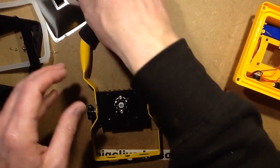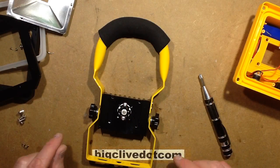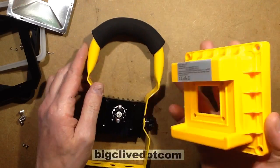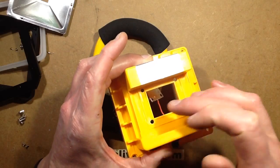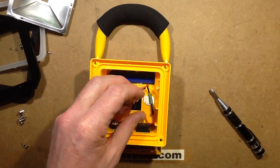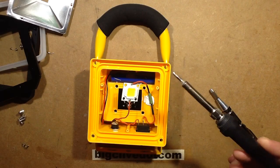I'm wondering now if the LED is going to stick up too proud, and whether those screws are going to stop the reflector going in. I guess there's only one way to find out — I can always change them for the original shorter ones. Now is also the point where I could have put some silicone sealant around here, but it's a bit of a one-way trip. I'll float some fresh solder onto that first, I think.